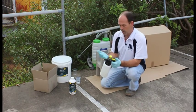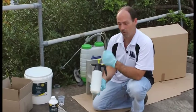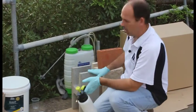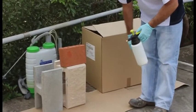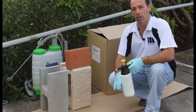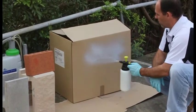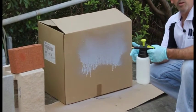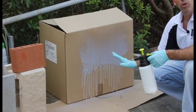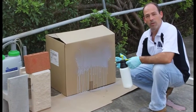The most important thing is this primer coat — this soak-in mix. If you apply the product directly to the surface undiluted, it's going to sit on there like a skin. The reason we dilute it is because you want it to penetrate deep into the masonry. You can see it started with water and then very quickly the white product came through. I'm applying that almost too quickly — we've got runoff. What you're trying to do is wet out the surface. You can see as the surface starts to wet, that white is slowly disappearing into the surface — and that's what you want.